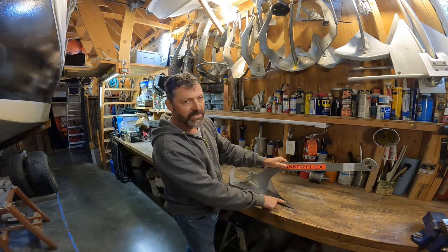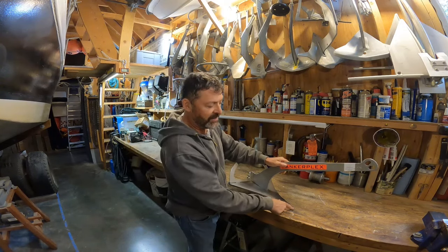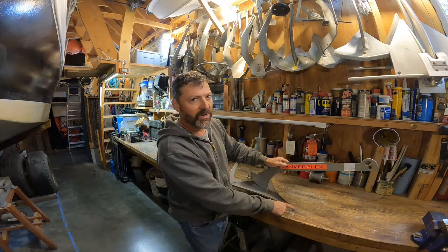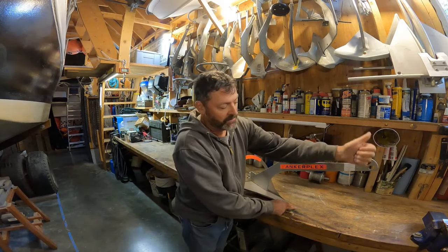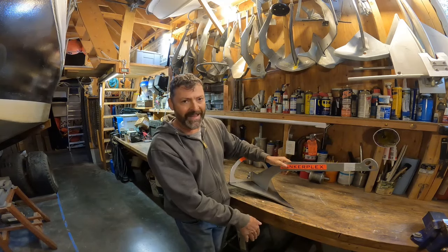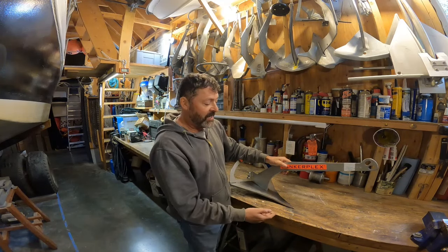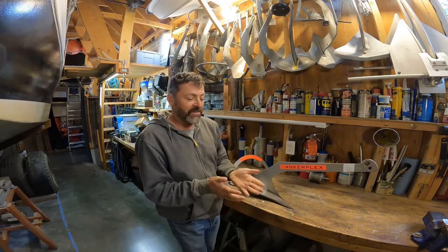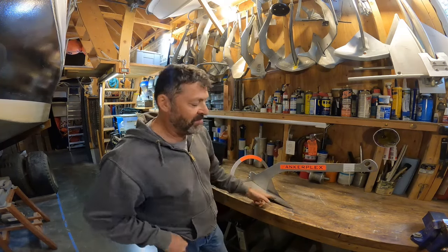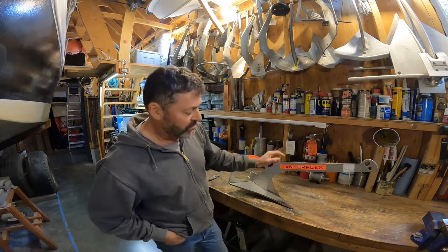Now, anchor toes are another vulnerable area. These get lodged under large boulders or perhaps a mooring block. And then when you go to retrieve, you've got a long lever arm here, and they will likely bend down in those situations. Many anchors have a thickened toe, or perhaps folds either upward or downward in the sheet metal, and that adds tremendously to the strength.